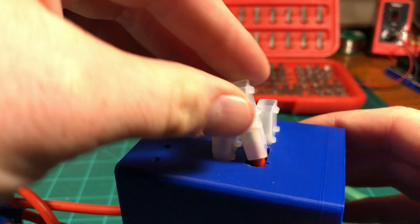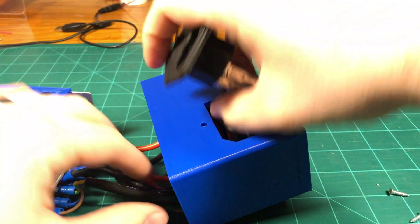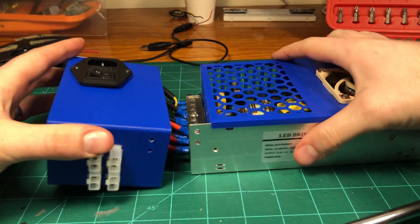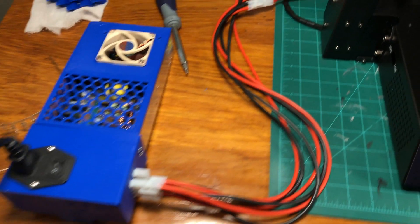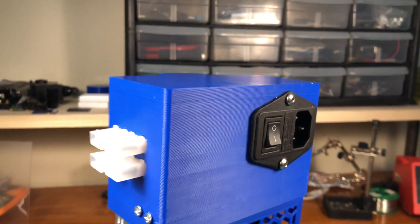Next, I created four short extension cables ending in female Tamiya plugs. These cables inserted into the power supply cap that I printed earlier and screw into the terminals on the power supply. With all the cables connected to the correct terminals, all that's left is to install the power inlet port on the cap and the cap onto the power supply. The last thing to do is create four longer extension cables with male Tamiya plugs on each end, so we can connect the power supply outside the enclosure to the printer cables inside. I have four output ports from the power supply and five things that need power, so I connected the two MOSFETs together on the same extension cord, meaning I only need four output ports from the power supply.